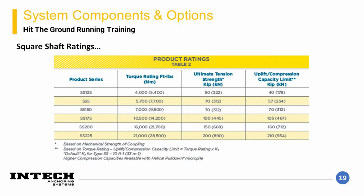It is important, in order to create the most cost-effective element, that the elements are spaced in a way that maximizes the capacity of the pile. It is generally efficient to try to match up the element spacing to result in pile loads that are close to the shaft's max capacity. Some soil scenarios, such as gravelly or cobbly profiles, may require the opposite approach to be taken to account for localized spots of increased torque required to penetrate them.